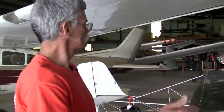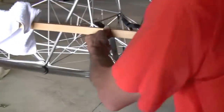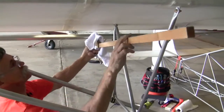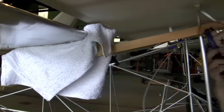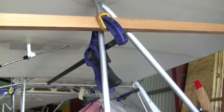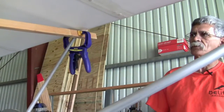Free-flowing, no binding. This is your flaperon rigging template — always put a rag or something on there to keep it from scarring. It's going to set up like that. Clamp it in place. Always clamp two places so that it's not going to move at all on you.